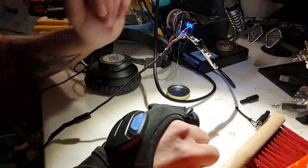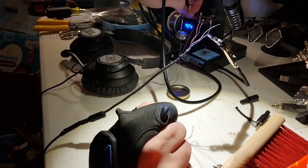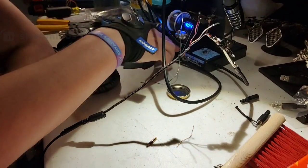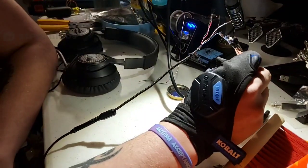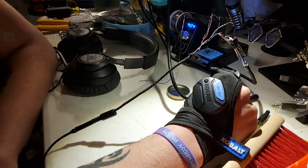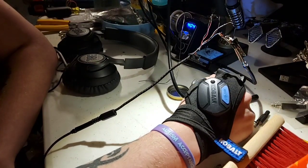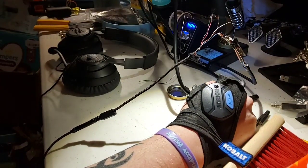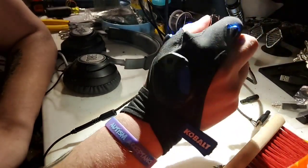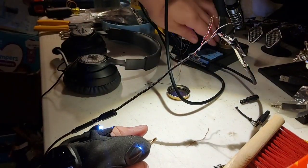All right. The last little bit here is to look at the soldering. I don't know if you can see it. Yeah, you can. It says 404 on there. That's 404 degrees Celsius, because I've got it set to Celsius. It's pretty standard for most solders to melt. This one also has a sleep mode, so if it was sleeping, you would see SLP, which it might go to in just a few seconds if I don't start doing things with it. Which reminds me, I need to put some water on this.